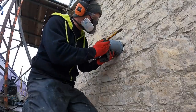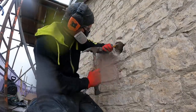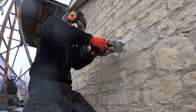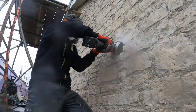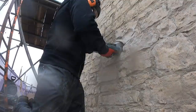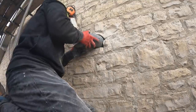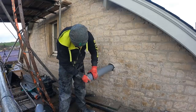I'm afraid I gave in — I've ended up using plastic here. Everything else on the roof I've managed to keep either original or a brand new version in metal. Now this little run that comes out is basically going to be plastic inside the building, which is fine. Where it comes out and comes across in a short run to this cast iron stack, I just couldn't bring myself to spend hundreds of pounds on new cast iron. Even if I was using the old style, I'd have a horizontal join there, so a whole bunch of joints and brackets. I guess it's a bit of a compromise, but all things come down to budget in the end — also the fact I can get it all in one run, nice and lightweight, easy to use, and easy to transition from inside to outside. So apart from you and me, by the time this is all painted, I don't think this decision will be keeping me up at night.